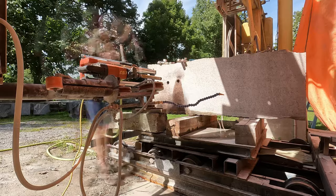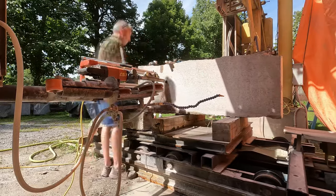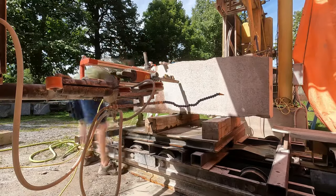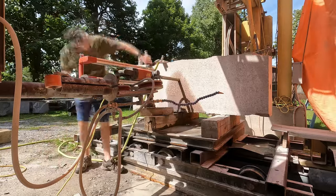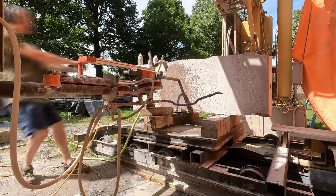The process is I move the machine to the next hole, then I mark where the hole is going to be, and I use a handheld grinder just to start the hole — because otherwise the long bit has a tendency to walk across the stone.